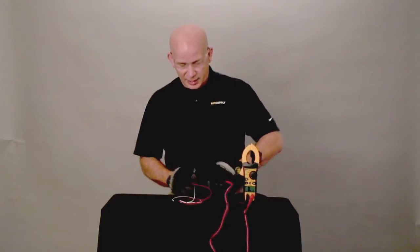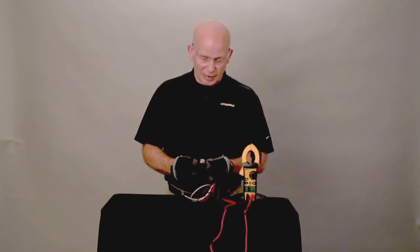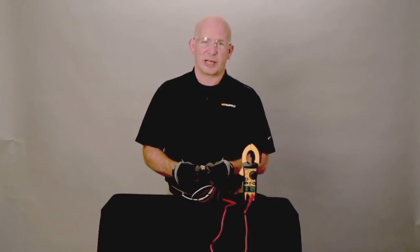And it does. This is a good thermostat — L45-20F. So 45-20F, or 25 degrees, is when this thermostat would reset. You would have to drop the temperature of this thermostat below 25 degrees to test it in the closed position.